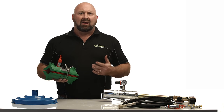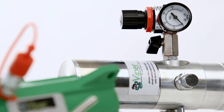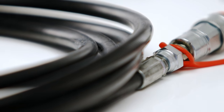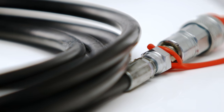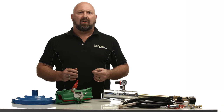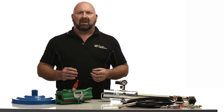And finally, the pump package. With the Viper Mini, we provide a basic pump kit for lubricating ropes up to 30 millimetres. This pump delivers lubricant at approximately 1.5 kilograms per minute. However, for ropes above 30 millimetres up to 35 millimetres in size, we provide a high-speed pump kit which delivers lubricant at approximately 4.5 kilos per minute.